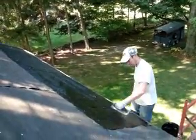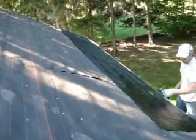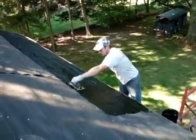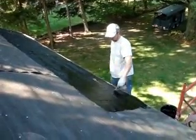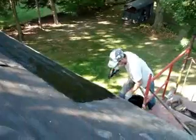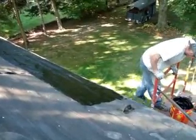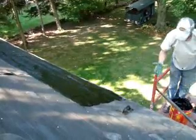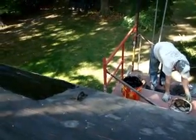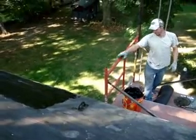The felt underlayment is punctured by thousands of nails and is no longer effectively watertight. The purpose of the underlayment is simply to keep the water out until the roof is installed. Once the roof is installed, the underlayment really doesn't serve any long term purpose and in fact will totally disintegrate. But this mastic lasts a long time — you can find it still intact on 100 year old roofs. By applying a layer between two layers of felt, we're creating a long term ice dam protection eave installation. Adding a five inch headlap along the eaves on this 8-12 slope will make a very watertight, ice dam resistant eave installation.